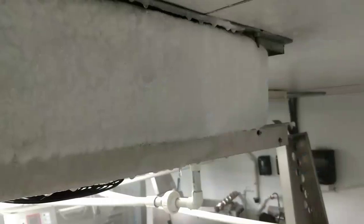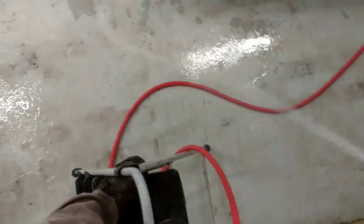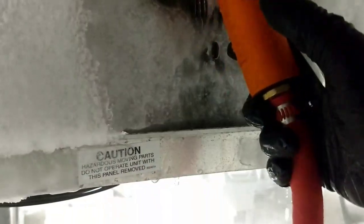Got a full sight glass. Looks like I missed one — I didn't come behind here because these machines are in the way. But it goes to show you: where you don't look is where you're going to have a problem. This coil is all iced up. Using some hot water here slowly. Lucky for me, this production room has a drain, so I don't have to worry about making too big of a mess — as long as I don't burn up some evaporator fans in the process.